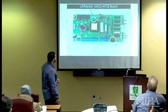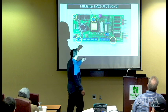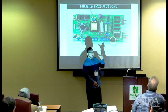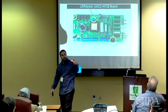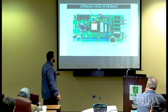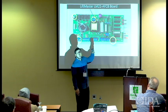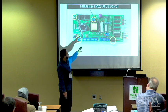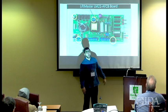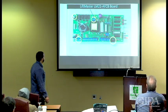Okay. It has its own onboard transformer as well as the chips. You see this strip here, this light tells you that it's powered. If that light is not on, then you may want to make sure that it's sitting down properly on the pegs, because it can easily get off balance. That happens quite a bit when you're dealing with circuitry. Another thing I would say is, if it's not sitting down properly on the peg, because we use this board in other situations, you can power this unit right here as well with 24 volts. Okay? So, in a nutshell, that's that particular one.